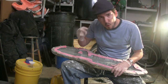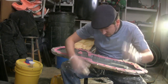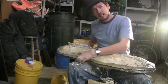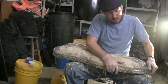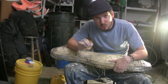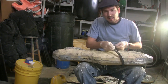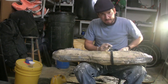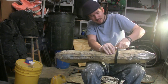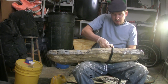Now that we have both halves plastiked up, we're going to combine the two. Take both halves, stack them one on top of the other, and strap them together as tight as we possibly can — we're talking silk-scarves-to-the-bed-post tight. Because if it's loose, you're going to have plastic leaking out all over the place. Keep it tight enough so nothing leaks out. Not that that's ever happened before — it's not like I've ever poured plastic on my foot and lost all the hair on my toes pulling it off. I'm just looking out for you guys.